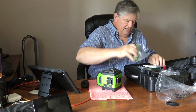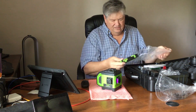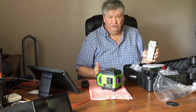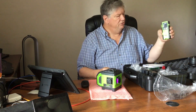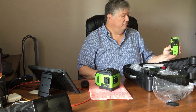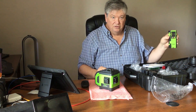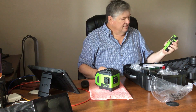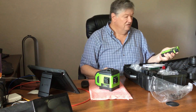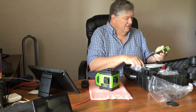There's also a laser receiver — this is the LR-6RG. This is used so if you're leveling a yard or digging a foundation, you can put this on a pole and set it up anywhere up to 65 meters away from the actual level and it'll read the green laser. It tells you if you're too high or too low. This is a green laser, so it's four times brighter than red lasers, but even in outdoor sunny conditions you can't really see the laser that far. With this device you can get a reading up to 65 meters away.